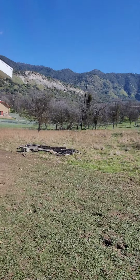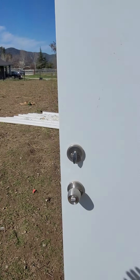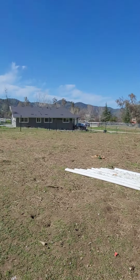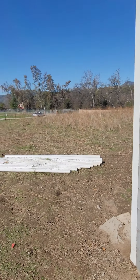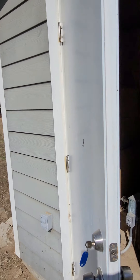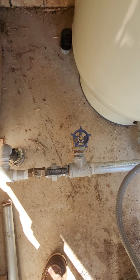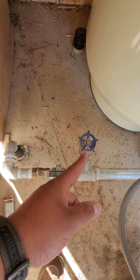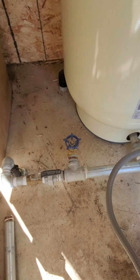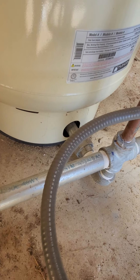You calibrate the PSI to determine your system setup, but guys that don't know probably won't even bother to check it. What happened here: these guys went straight into the main from the house — big no-no. Their irrigation water should have come from the well. The guys who dug and installed the well did a fantastic job, everything's really nice and simplified. But the prior irrigation guy forgot to run his irrigation from the dedicated irrigation shutoff — it's a blue valve, blue for a reason.